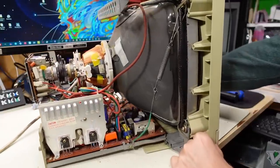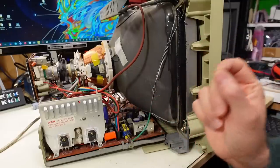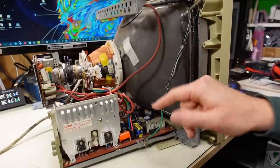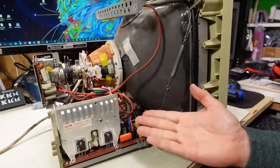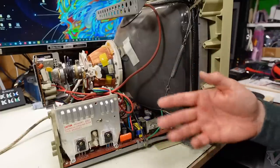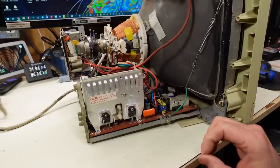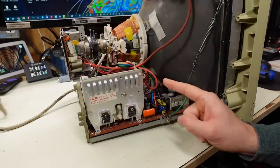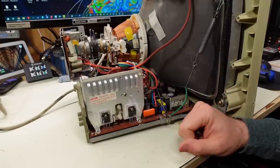Now this thing is open. One thing I can say is this was probably not used in a school, because it has a real aroma of cigarette smoke, which is not great. It doesn't look too dirty on the inside - there's definitely some soot on things, but I don't think this thing is super high hour. Usually when these things have been used around smokers, when you first turn them on and they start to get hot, they really start to smell. Take a look at this label: 'Caution - primary hot common ground is on this bracket.' So while this thing has a partially isolated design because of course it has video inputs, this ground here is part of the hot side of the chassis.